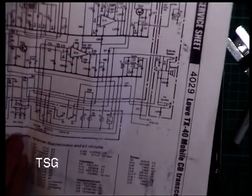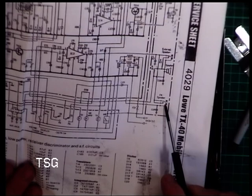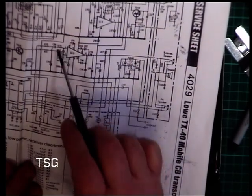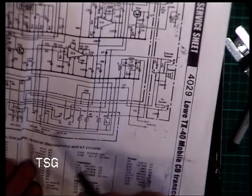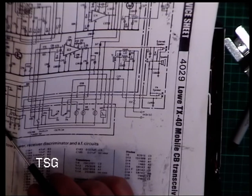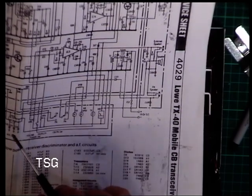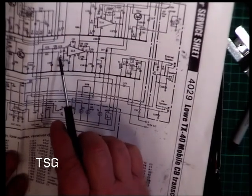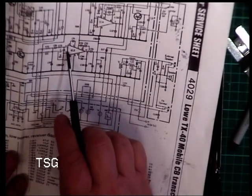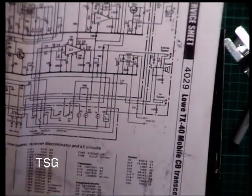That's the camera's remote on the floor. So we've got the public address speaker there. We've got the audio amplifier here. And somewhere we'll have a microphone preamplifier arrangement. So I think what we just need to do for a start is if we put a signal on pin 5 or 7 of the audio amplifier, well, of course, we should get something coming out of the speaker.